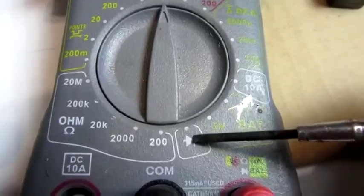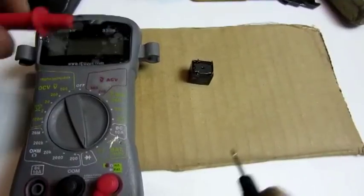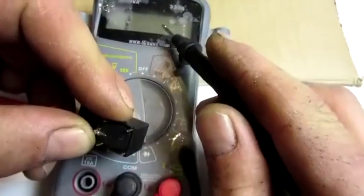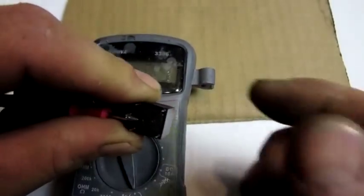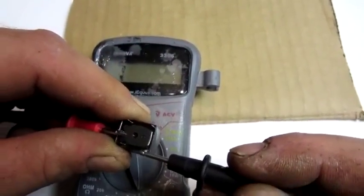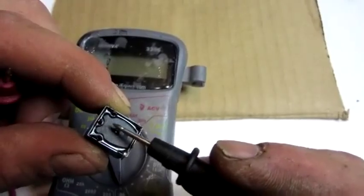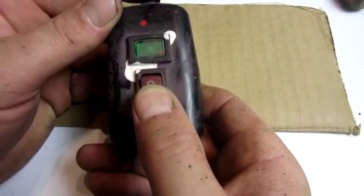We have a voltmeter — set it to continuity. You have two wires, red and black. This wire right here will always have something connected to it — we've got to find the normally closed. When the numbers move it tells me it's closed; that's open, that's closed. If you hook a wire here to here it's just like they're touching. So we bend that down so we know that is normally closed — we are not going to use that for this project. We are going to use the normally open circuit. Get your 12 volts on each side, and the wire you're going to split goes from here to here.